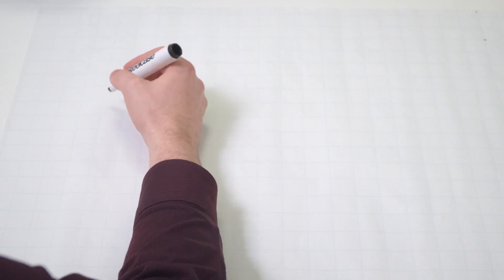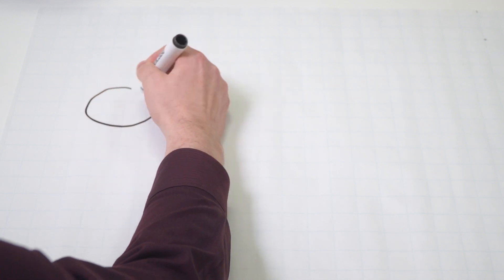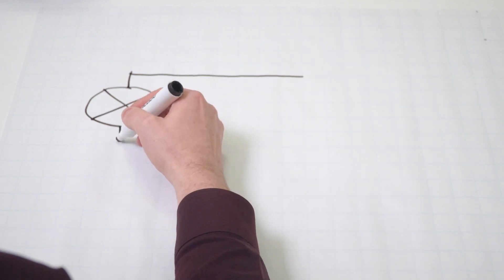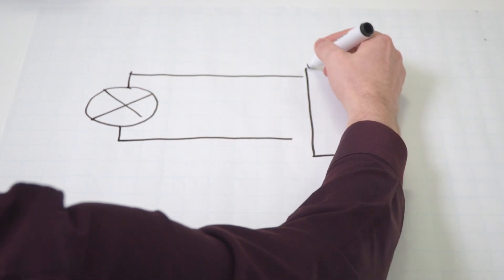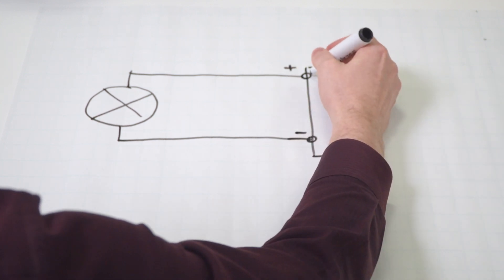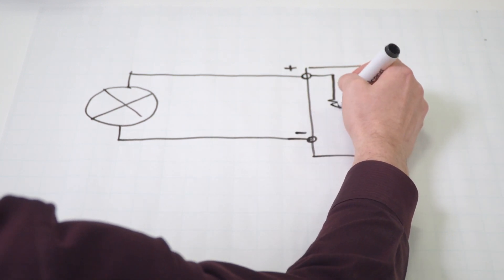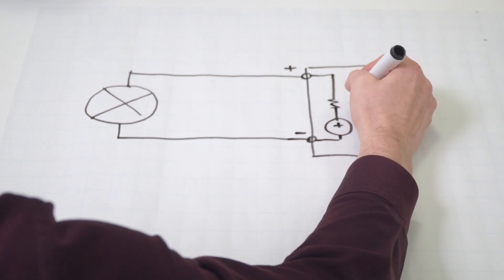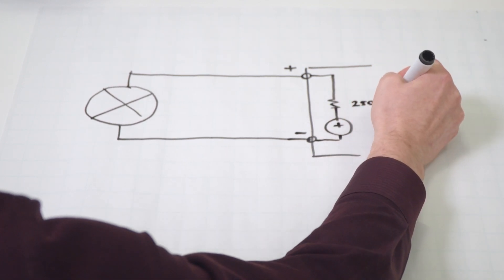If you're making a scrunchy face about the resistor, let me show you why you need this. Most HART devices are loop powered, meaning they get power from the PLC card they're connected to. The PLC input essentially has a power supply and some input impedance built in, normally around 250 ohms. If you remember from one of my previous videos, the HART signal is superimposed onto a 4-20 milliamp signal and is actually a small AC voltage. If you're familiar with basic electronics, you know that you have to measure the voltage across a resistor. Now let's wire this up and see what we get.